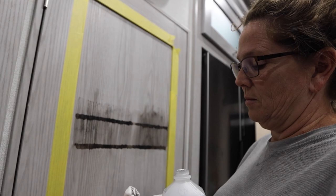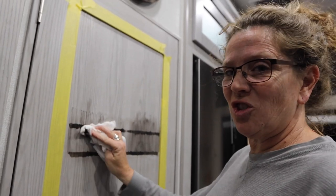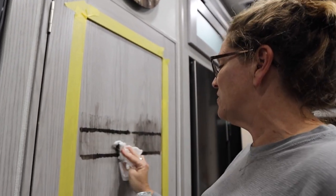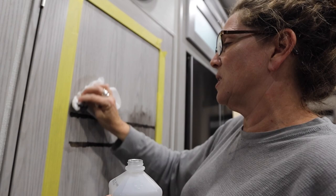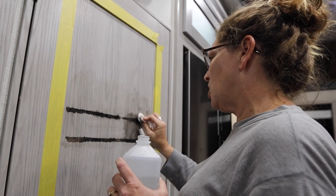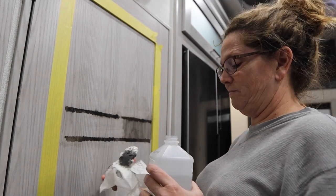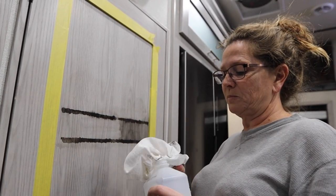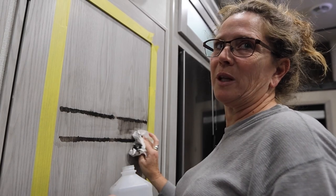So what are you doing now? Did we make a mistake? Well, I sanded first, which is what I was told we needed to do. But everything I've done with this paper-ish woodwork, I've had to wipe with alcohol even just to get command strips to stick. So I probably should have washed it off real good with alcohol, because when I started putting the paint on it wasn't sticking. So I'll get this paint off, wipe it with alcohol, and sand it again. Here's your Tuesday tip first: make sure you clean very well before you try to apply the paint.